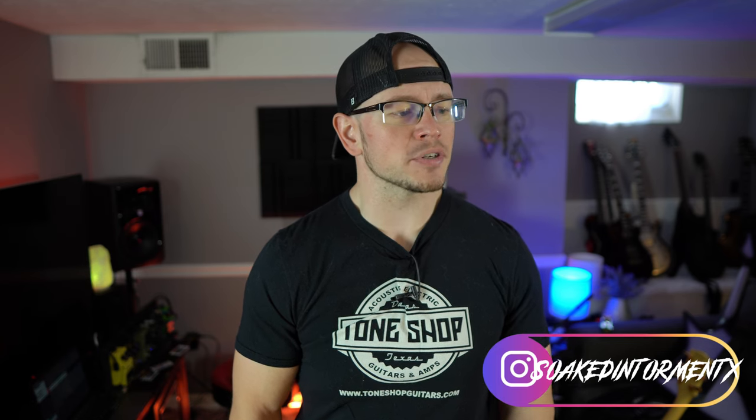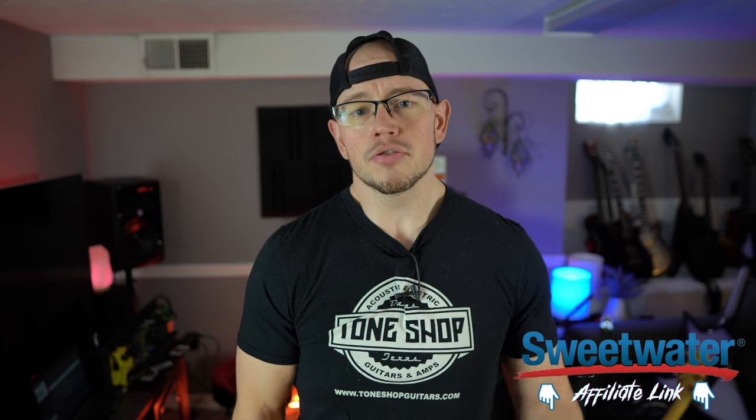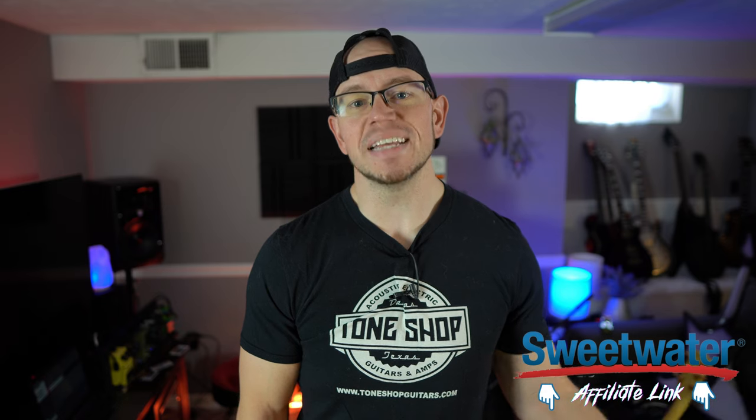All right, this video is 100% off the cuff and the reason for that is I just picked up a Mesa 400 Plus bass amp. If you guys are unfamiliar with that, the Mesa 400 Plus is a legendary 300-watt 12 6L6 power tube beast of a bass amp. So what does that have to do with lunchbox amps? I'm a big fan of slaving the preamp out of one amp into the power section of another amp to kind of mix and match different tones, but with certain amplifiers that is not a possibility unless you have the right equipment.